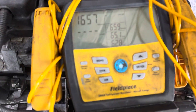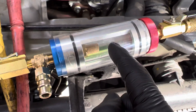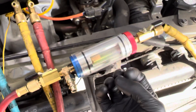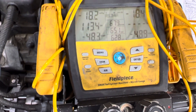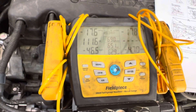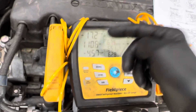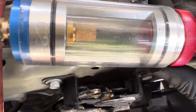There we go, we're going into the microns now - we're done on that one. As you can see the oil is no longer bubbling because it's under such a low vacuum. It has a little heat to it and it boiled the refrigerant out of the oil. If you remember when we first looked at the refrigerant oil it was bubbling because that was trapped refrigerant inside the oil - like CO2 in your Coca-Cola. You can see how slowly the refrigerant is bubbling and boiling out now - that's why the number is falling back down. I'll do it a few more times - there you go, you can see that little bit of oil inside there.